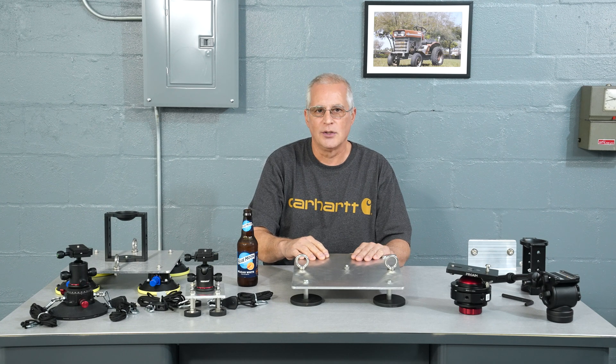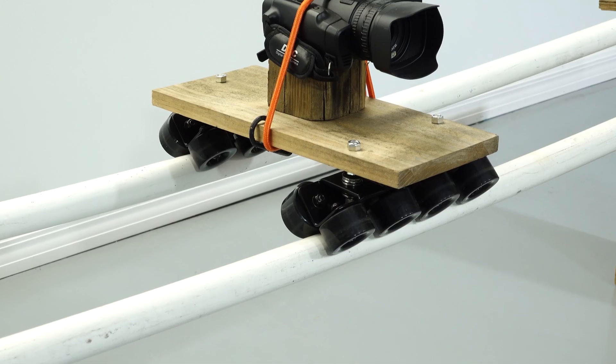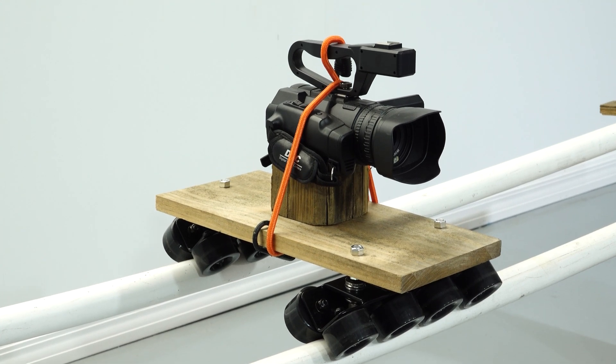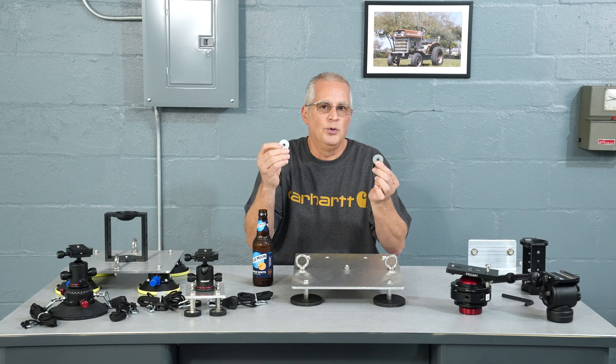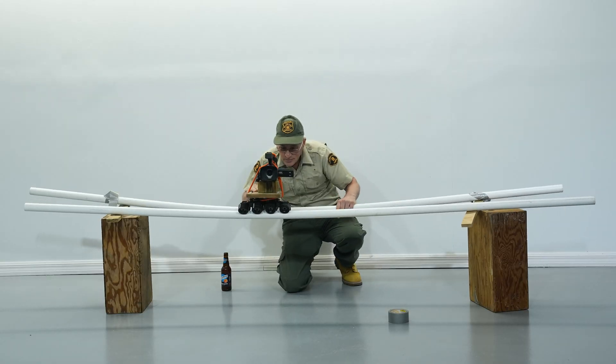In both cases, I used an aluminum plate so you don't have any loss of magnetic stickiness and to keep the camera away from the magnetic field. 6061 T6 aluminum is very rigid and light. A lot of you are going to be tempted to use plywood, and that's fine. Just make sure you use large fender washers around the holes so the bolts won't pull through the wood. But honestly, I don't know if plywood would be any cheaper, and it certainly won't look very professional.